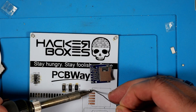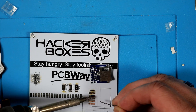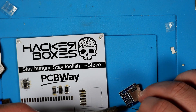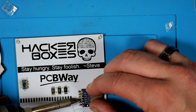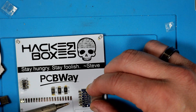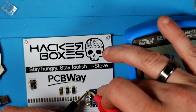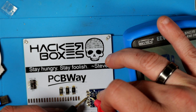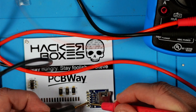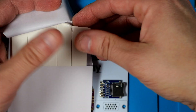Next up is the SD card module. The Instructable goes into two different ways to solder this on. I'm going to preload the pads first, then load solder into the holes, and hold it in position while alternating heat between the pad and the hole until I see the heat make it all the way through for a solid connection. I give it a little tug after to make sure it's fully in place. I use my multimeter to check connectivity between the via and the pad — I noticed one spot without continuity, so I went back, added heat, and rechecked until it was good.